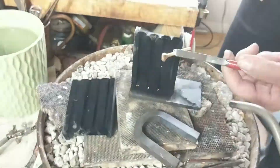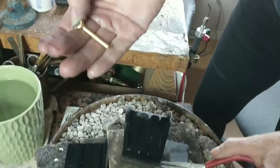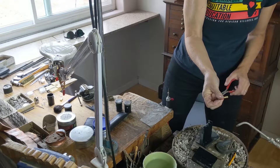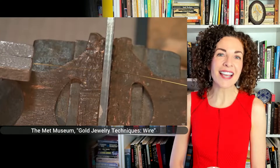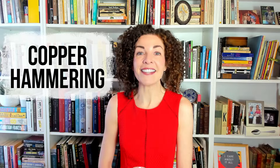After dipping it in water, it is cooled enough to hold in her hand. The mold was a little cold — it should have gone all the way down instead of chilling at the top, because the mold wasn't heated evenly enough. But she can probably still use it. Gold can be cast, pulled into very thin wires, and hammered into sheets thinner than paper. Copper is another metal that can be shaped and hardened by hammering, as Alix shows in this next demonstration.